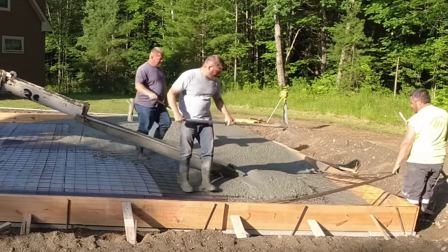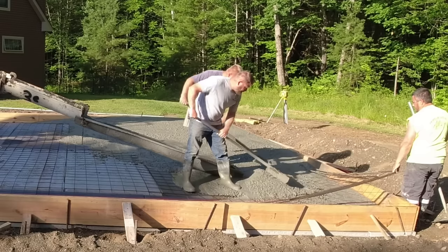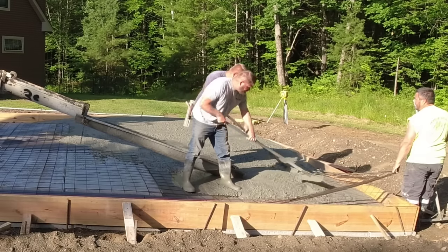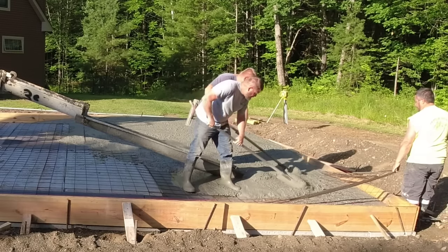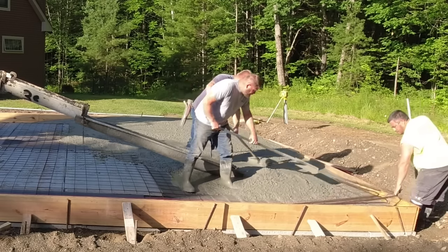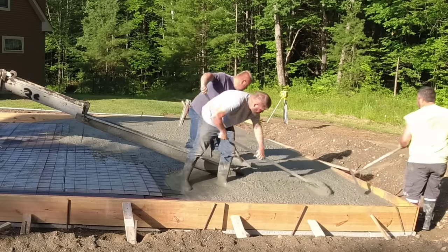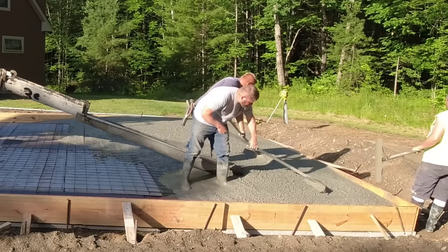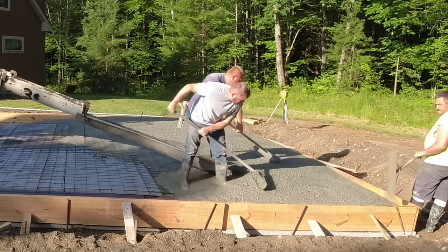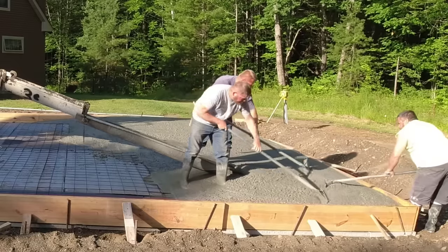So that's basically the base we start with. We'll come in after that and set up the two by 12s, put the styrofoam down, the wire, the rebar, and all that to get the slab ready. One of the things I think about when I start scheduling these slabs is, number one, the weather — we've got to have a good day. I'm looking a day, two days, even a week from now, and getting the slab scheduled with the concrete company.